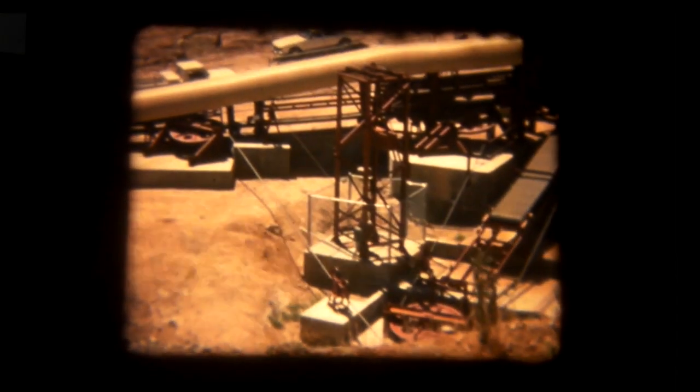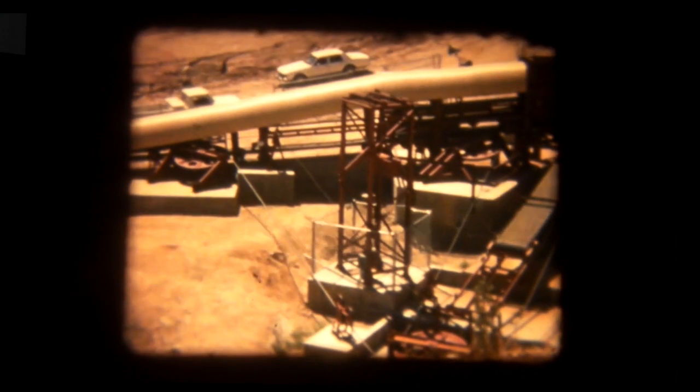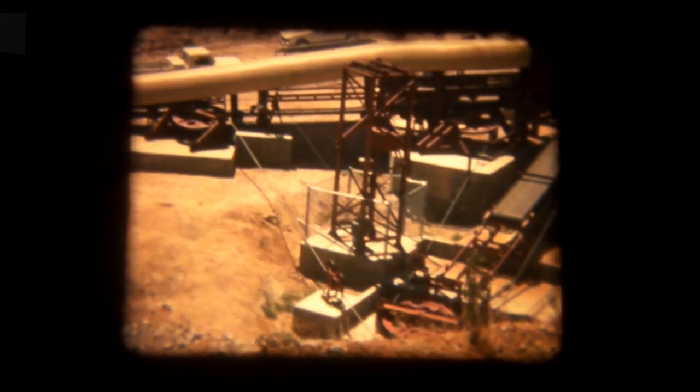Now, I think, we come to the clever bit. This is the angle station where the load is diverted by 60 degrees. The material on the incoming belt, in the background, is lifted up and dropped into a chute, which is over another belt which runs off at the desired angle. Both belts are moved by the main drive, which is why we have several rope guide pulleys in this area. The incoming belt must have had its own tensioning arrangements, but I don't recall how this was linked into the signalling system.